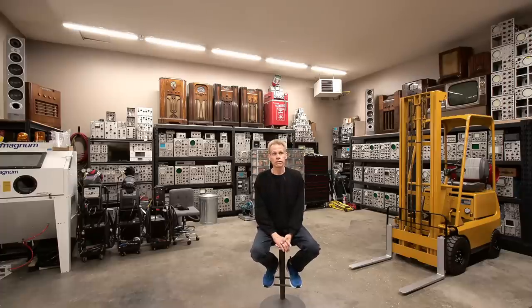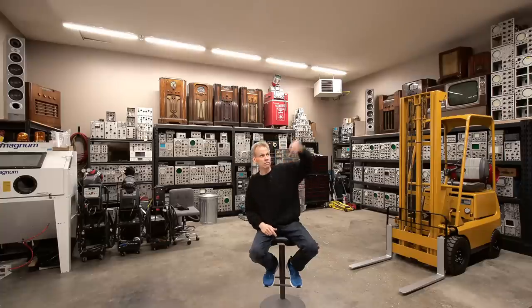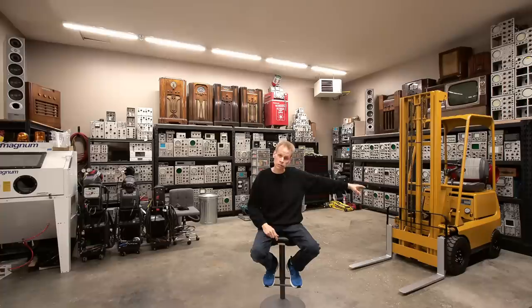Okay, so when I got home, I inspected it. And what had happened, what are the chances? The shaft of the motor that this was put onto had one piece of shaft that was threaded into the other piece of shaft, and they were perfectly aligned. The keyway was perfectly aligned. The motor ran backwards to the way that the end shaft was threaded in. So as soon as it started and got any force going, that end shaft unthreaded out of the motor and left and hit the ceiling and the floor and the ceiling and the floor.